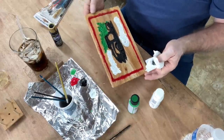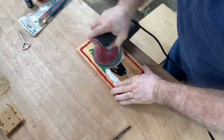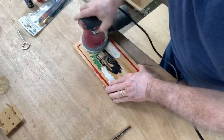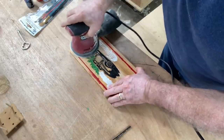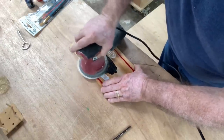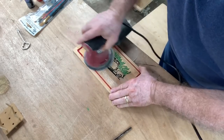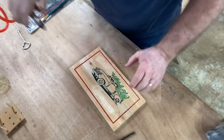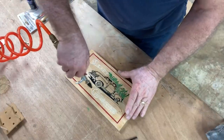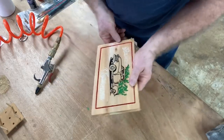So I'm going to go ahead and let this dry for a few minutes. Now that it's dry — or I should say almost dry, because I actually started sanding just a little bit premature — but what the heck, I'm going to go ahead and march on. We're going to sand all of this surface down and clean up all of the excess paint that was on the surface. I'm using a 60-grit sandpaper, so it's actually quite rough, and again that's in keeping with the whole theme of wanting a rustic project. Now I'm taking the air compressor and just spraying off all of the excess sawdust to clean it up, and now we can see what it looks like. Now that all of that is finished, I actually think it looks pretty good. Let's move on to the next step.